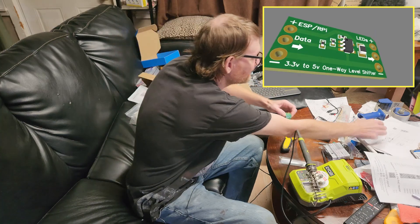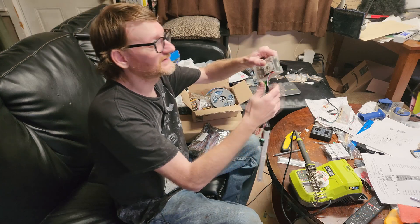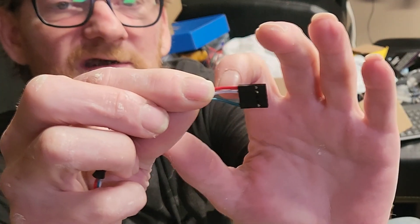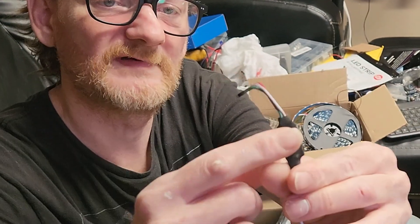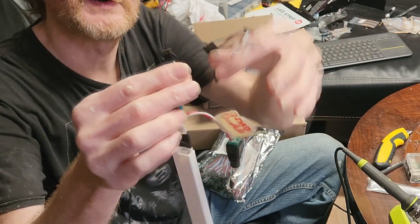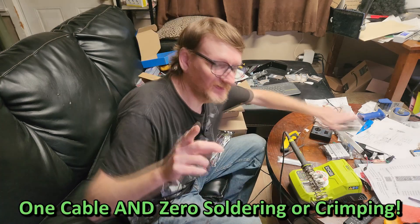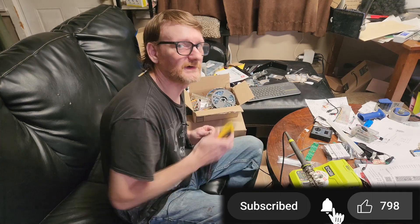It's so small that the whole thing, once you put your wires on there, fits into a piece of heat shrink. This is the Pi version — I'm making several versions, same board, the only difference is the Pi version has a five pin dupont connector. You've got your positive, your negative, skip two pins, and then that is GPIO 18 that feeds the level shifter, and the level shifter then feeds the LEDs with their data. The cool part is the LED strip feeds five volts to the Raspberry Pi — so it's a one cable solution for the whole thing.